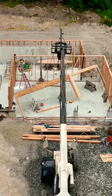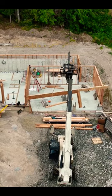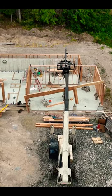That is a Roseburg 5¼ by 16 inch LVL to a Doug Fir 6x10, with two king studs in the middle, and then a combination of either 6x6 or 4x6 columns.